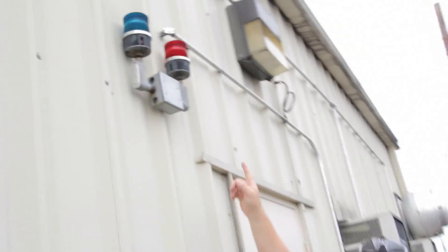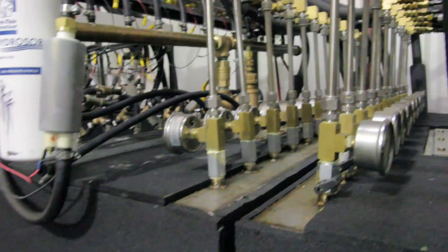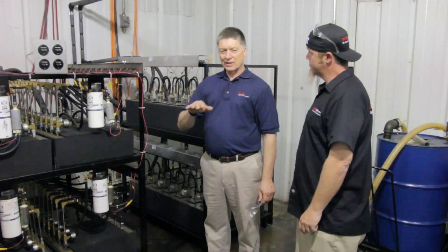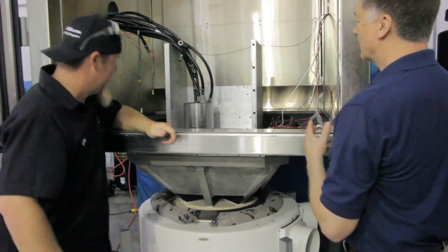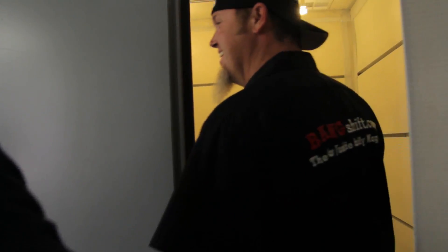Any place that has lights and colors of police is always a point of interest — it means you're going to the right door. You're testing fuel pumps in here to determine durability — this is strictly durability. What we're trying to replicate is passenger car conditions. We say that a 1,000-hour test would be about equal to one year's driving for an average driver — or if you live in Los Angeles, approximately a month. And if we want to get a little bit rougher on them, we shake them at the same time — a shake-and-bake unit. We can make it hot or cold and shake the unit, with a temperature unit on top, and if we want to run the pumps while doing that we bring the fuel in from outside.